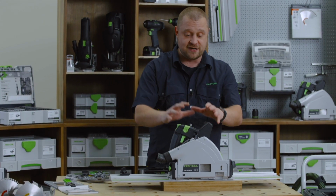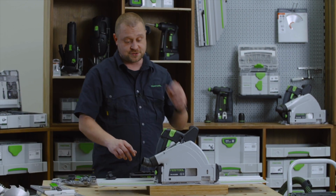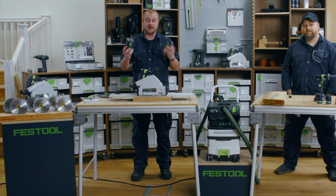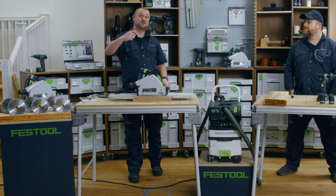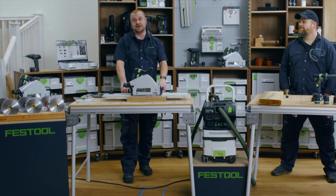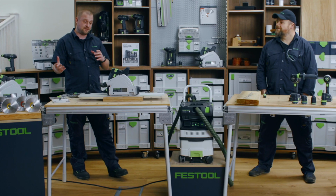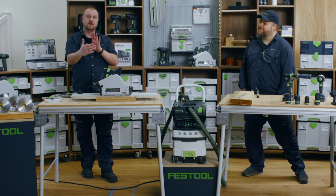And that's where it really comes in particular with the cordless and why I've put the corded to one side. Because of course, with the cordless tool, we're running from batteries. And batteries take power to run the machine. The fact that we're using a blade that now cuts up to twice as fast means we get up to twice as long out of our batteries. Absolutely. So a real big shift in thought process and what the machine's capabilities are by making that blade thinner.